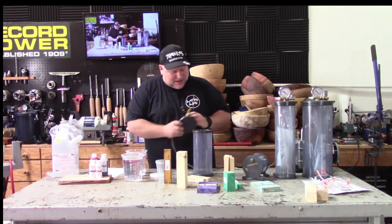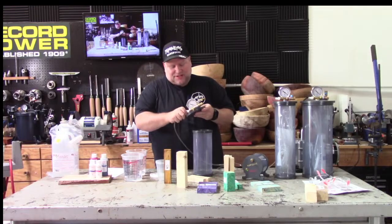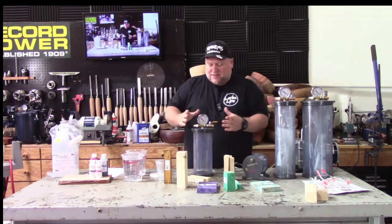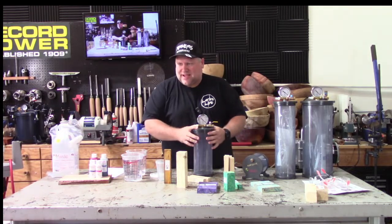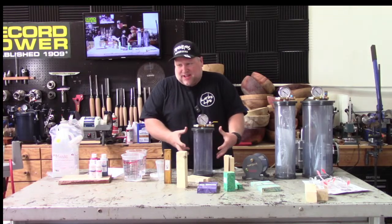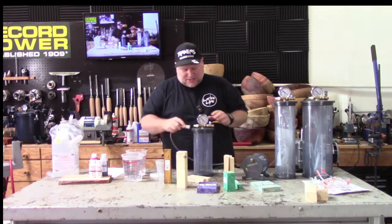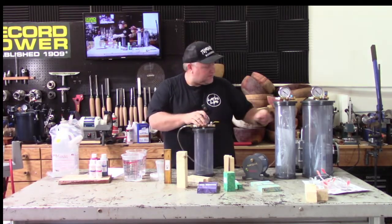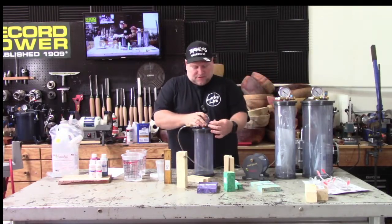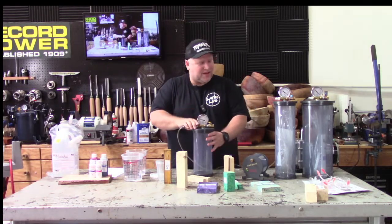When you're stabilizing, the other thing about this chamber is it's very convenient. So you've got the quick disconnect. The lid literally just sets on there. The reason it just sets on there and doesn't have to bolt down is because once this is turned on, we're sucking the air out of it. So it's literally pulling everything together. So once this is on, the lid stays on because we are pulling it all together.